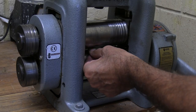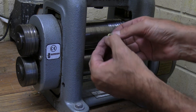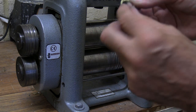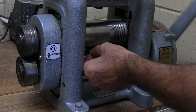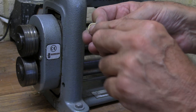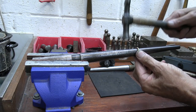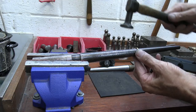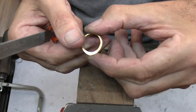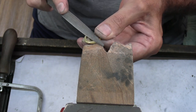Feed the very top of the ring in but not very far — only around about 10mm at the top. Tighten up again, run it in again, and that will give me enough room now to put a split in the top. You can see that it barely needs much filing up to get it into shape. I've just annealed it as well, so I'm ready to put the split in the top.